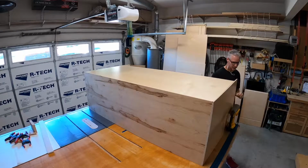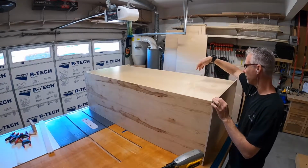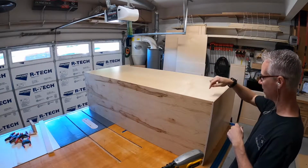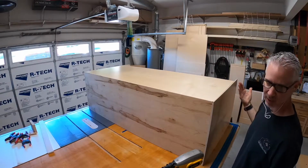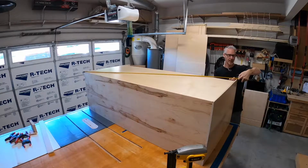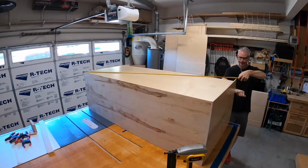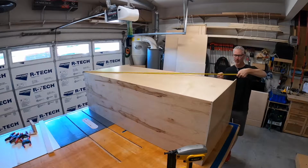But even though it's nice, really nice material, you could still have a problem. And there's a couple of defects on this piece, so I flipped it over. There's a little gouge right here. I know this is a lower cabinet, and you're probably never going to see it. That's 80 and an 1/8. So I'm 1/16 out. So I want to be at 80 and 1/16 right there.